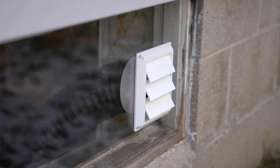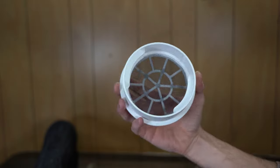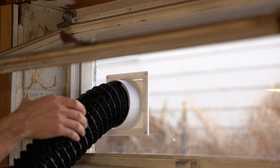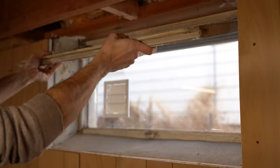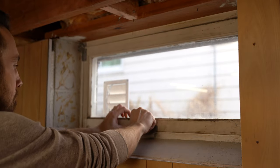Hello my friends. In this video I wanted to share with you my favorite solution for venting out a basement hopper style window, in hopes to give you some ideas for whatever project you have going on. The reason I love this particular solution so much is that it has self-closing louvers to prevent drafts from coming back in, a bug screen to keep those critters out, and an adapter which allows me to quickly disconnect my hose and still shut my window for security and insulation.